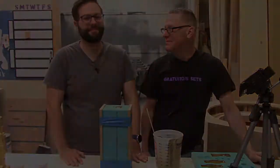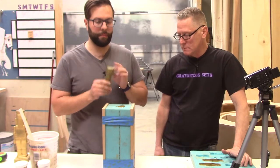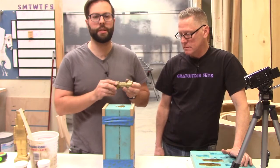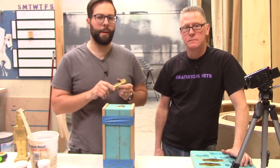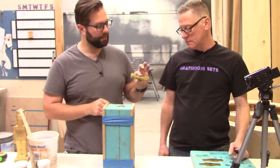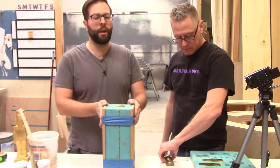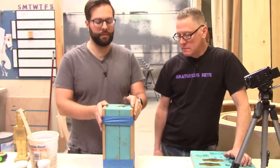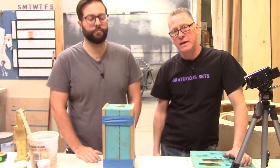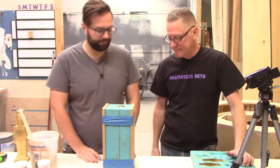All right, so we are about to demold to take a look at our piece. First, we popped one of our guys out of our scrap mold. Cure time on the resin we were using is 30 minutes. So at the 30-minute mark, we popped one of these out just to check to see if it was cured, and it looks pretty good. It's got just a tiny little bit of flex to it, but this guy's bigger, so it's going to cure faster than the smaller pieces will, so we should be ready. The larger volume will contain the heat and help the whole thing kick off that much faster. And science. So small pieces take longer than big pieces.